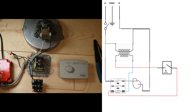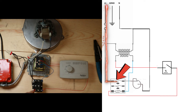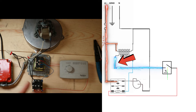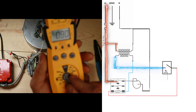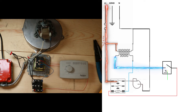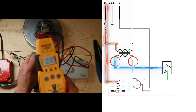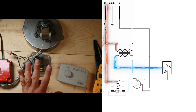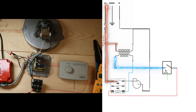All right, I have my power plugged in - let's turn our power switch on. Right now we should have power going up to terminal one on our relay and stopping right there. We also have power going to our transformer and should have 24 volts. Let's take our multimeter out, put it to volts AC, and test from one terminal to the other. We're reading about 30 volts, which confirms I have high voltage going to my transformer and it's giving me a low-voltage control signal. I can also test to see if I have power on terminal one.